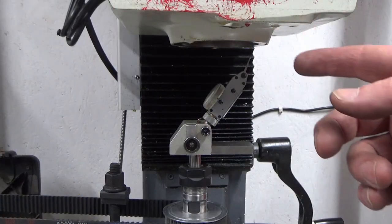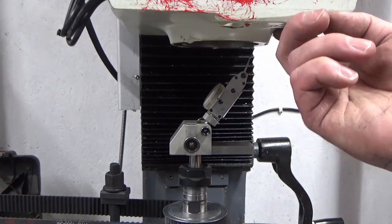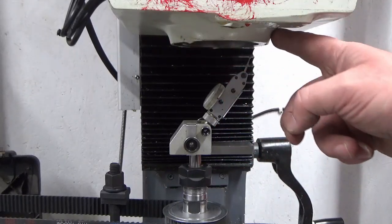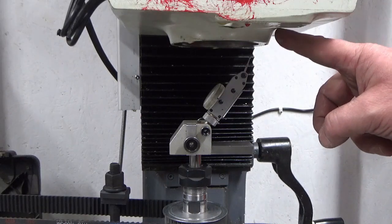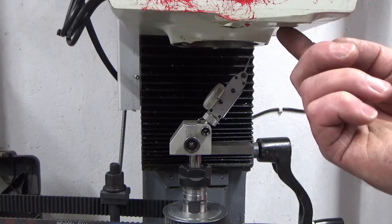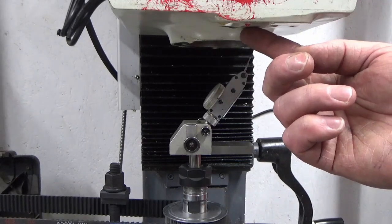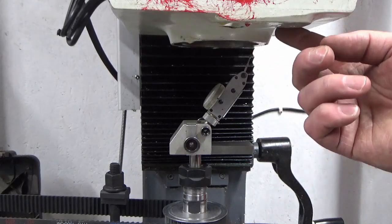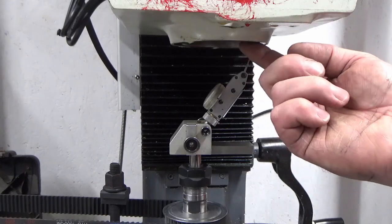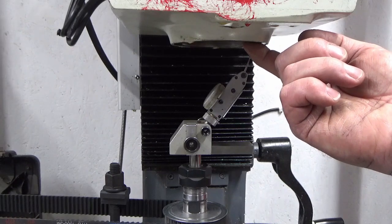Okay, so I've repositioned the camera, and what you can see here is an element of the casting that there's a big radius here around there, which is basically Bondo or plastic padding. This will be a parallel cast diameter below this. The drop from this bottom face to roughly the underside of the head, bearing in mind I'm measuring onto a Bondo surface that's painted and it's all so uneven, is about 16 or 17 millimeters. So I've currently got 16 or 17 millimeters of spindle or quill bore that is 1/10 of a millimeter bigger than it needs to be.